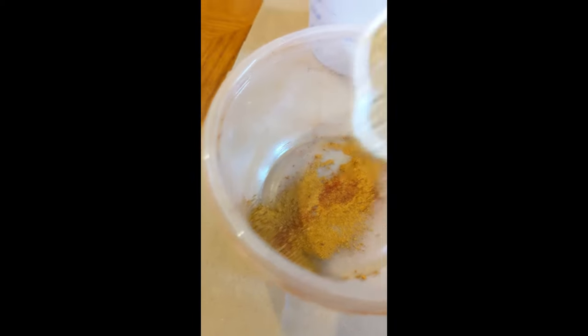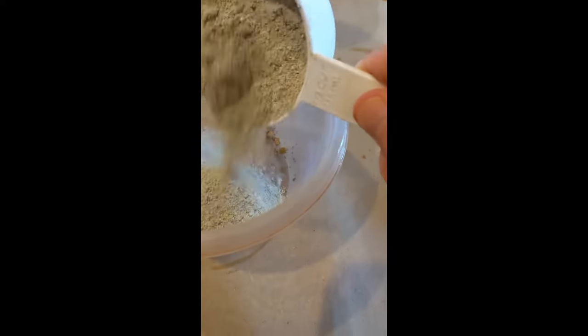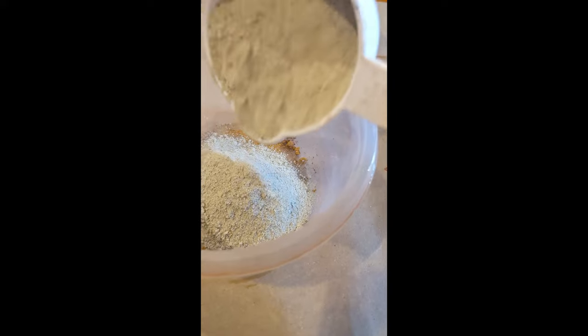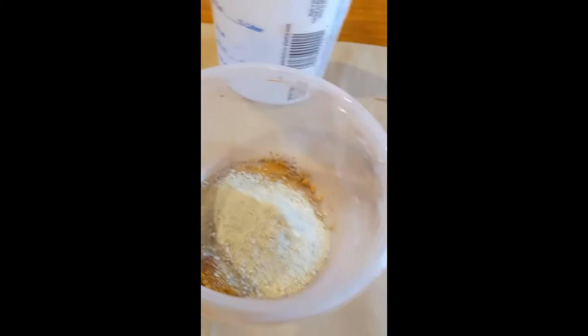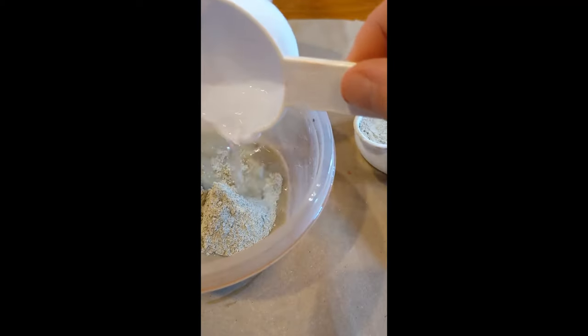To make those colors, we followed the instructions and got the right dye combination in there. Now we're going to add just a half cup of the mortar repair mix — not all of it at once. We'll put in about half, then add the water to make it a little extra soupy before adding in the rest of the mortar mix.